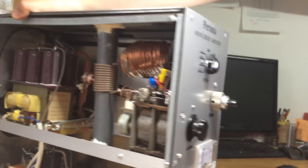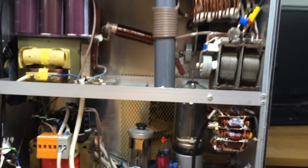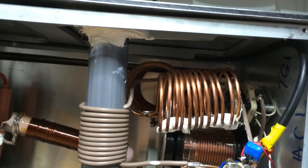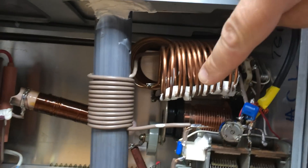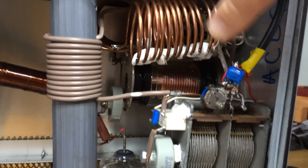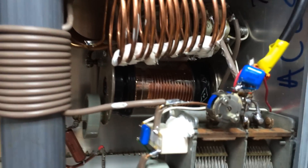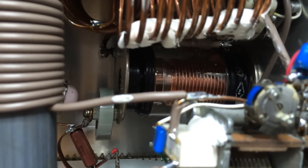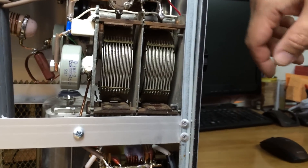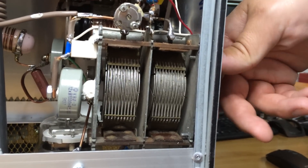It's the classical GK-71 tube — you can see the tube there, the anodic choke which is on top of the tube, the pi-coils, the pi-filter coils. In the other part of the package you can see the vacuum capacitor of the anode, and next to it is the load capacitor.